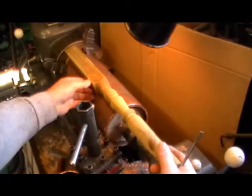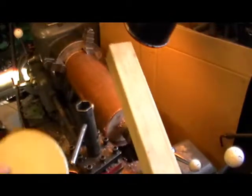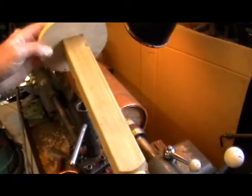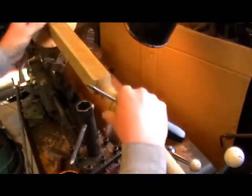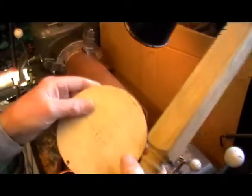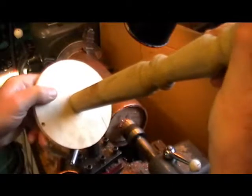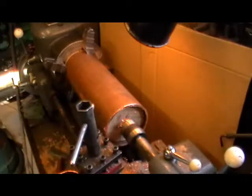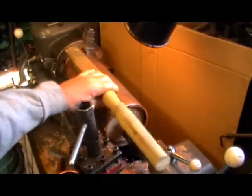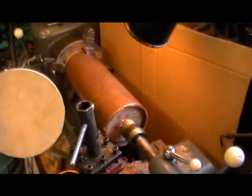I've put a support down the middle like so. I've taken a measurement of what I needed. It was 12 and a quarter inch, I think, and then on the chuck end I've screwed my disc to that piece of wood. It's a piece of 2x2 wood, so that's going up my barrel like that, and then I've sawn it to length at this end. You can use any wood as long as it's going to support it. And then on this plywood disc at the front, in my case I've just counterbored a little recess in the wood so that I could just locate my centre support like so. So I've got one end screwed to the chuck, and I've got the other one in a recess up the barrel here with a centre in, and I've put my revolving centre in.